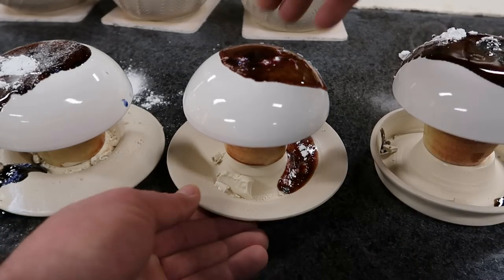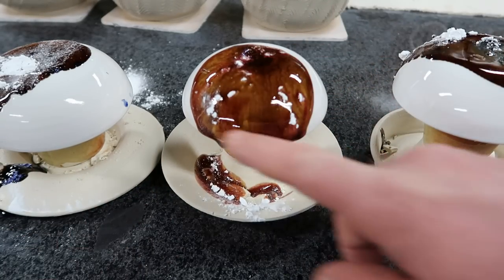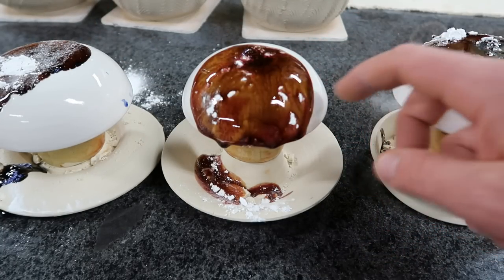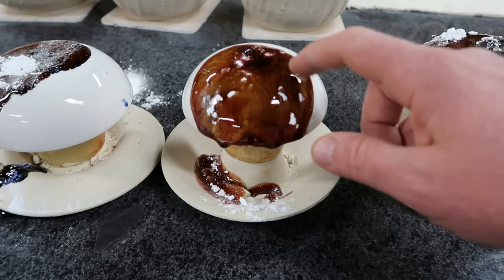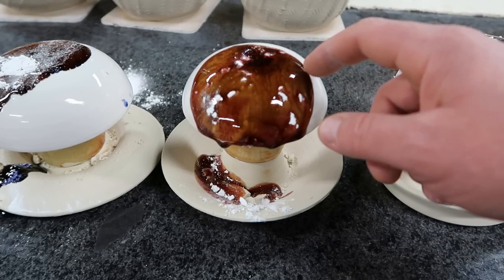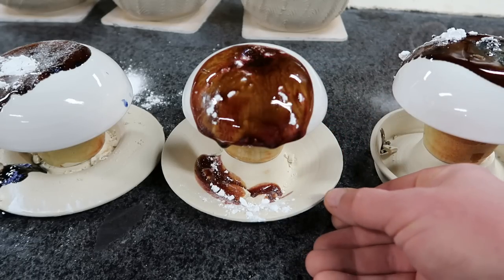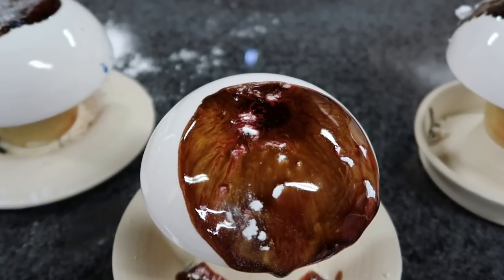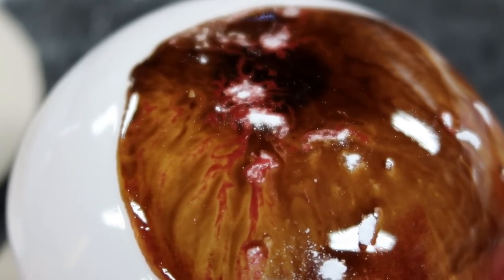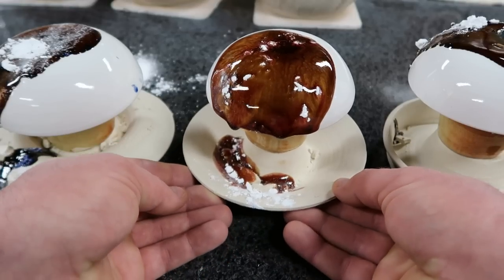Test number three: this is the red underglaze on top of the alumina. As before, the alumina didn't blend well. But one thing I've noticed — these have been out of the kiln and are cool, and usually by this point the glass is pretty crazed. So that's either a function of the alumina doing its job in some way, or possibly this glass is different than a normal beer bottle. Nonetheless, it's not crazing yet, which is really kind of cool. The Duncan Ceramics underglaze actually did nicely streak in the glass — the underglaze stayed nice and red. So it works.